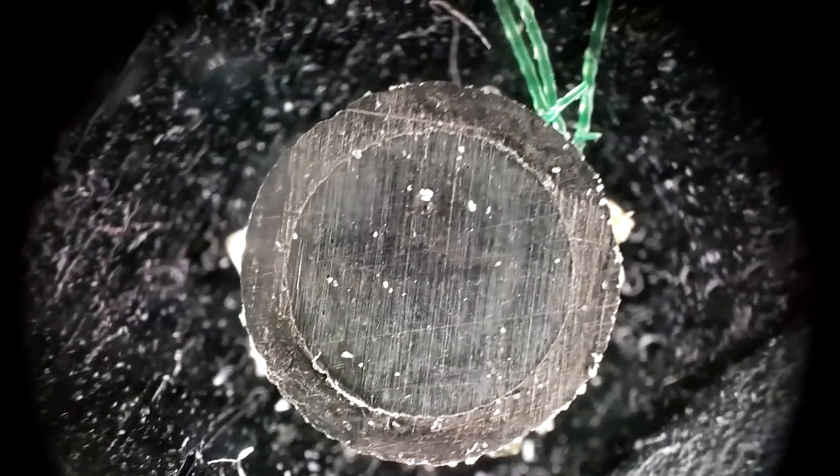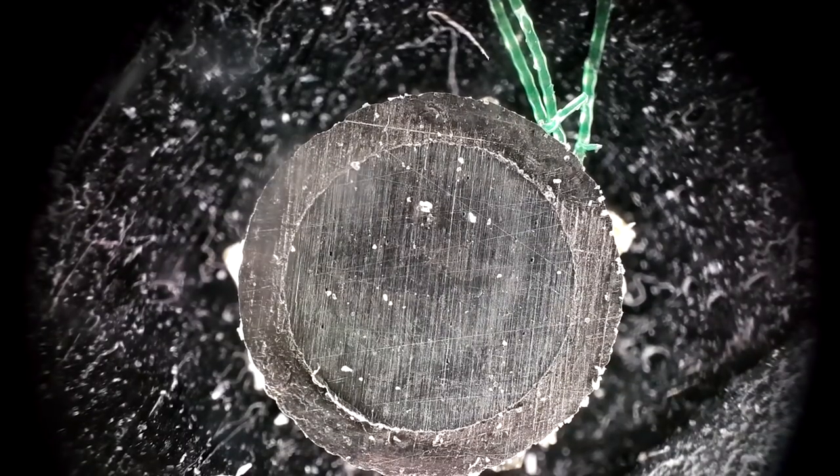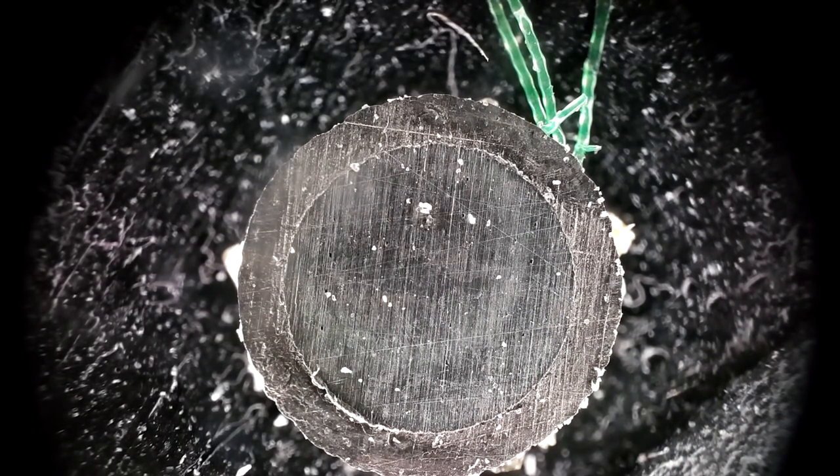We can see over on the bottom and the top in the field of view that there are some nice yellow diamonds peeking out from the other side of the disc. I am a little bit more comfortable doing this because the diamonds are pointing away this time. And there is some of the polymer fibre which is about 80 microns — that is the diameter of those fibres. They kind of make up the substrate along with the binder to hold these nickel discs that have the diamonds in them in place.